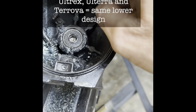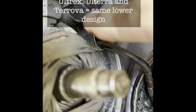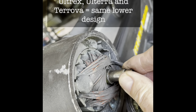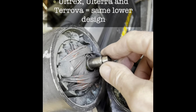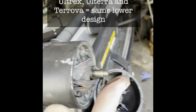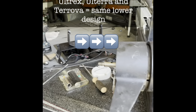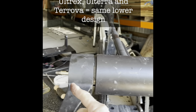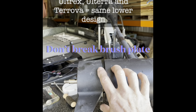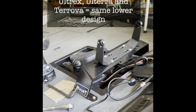These lineups are for your through bolts. Once the nose piece is off, you have your armature available to move. We moved the armature out this way — can't do it with two hands — before we tried to take this other piece off. Very carefully, so you don't have the issue where you're going to bend your brush plate. I already got it off — this is just for demonstration purposes.